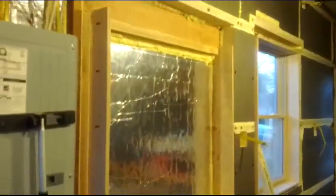Very simple installation — not perfect perfect, but pretty close, and certainly good enough for carpentry. Now on to cutting the base and the top. The sides are attached. This one hasn't been cut to length yet — it's supposed to get cut right there. But hopefully you can see that little offset there. That's what happens when I forget to make the mark that offsets for the blade — this piece is a blade's width too small, so I'm going to have to scrap it. If you're going to do this, be careful of your blade offset, or else make sure you buy lots of extra plywood.